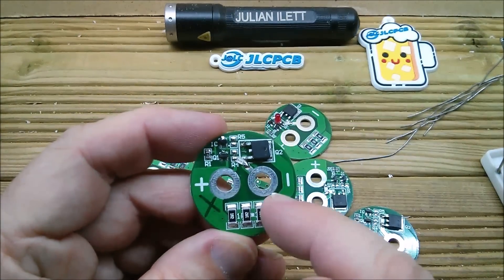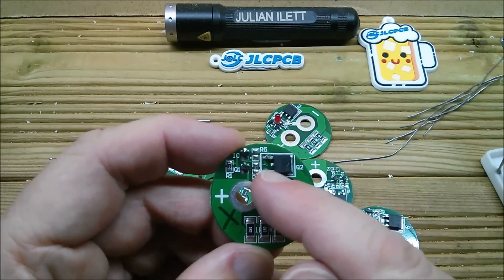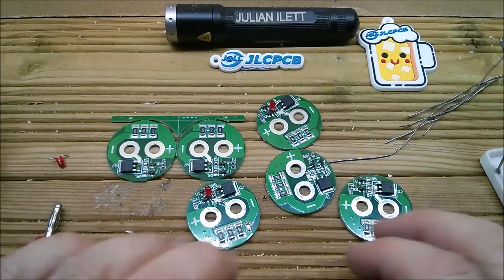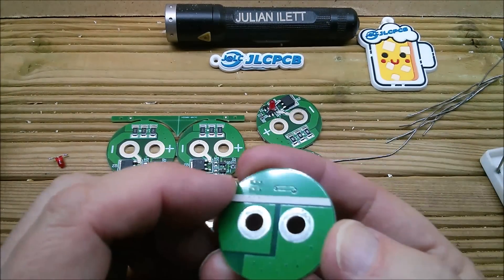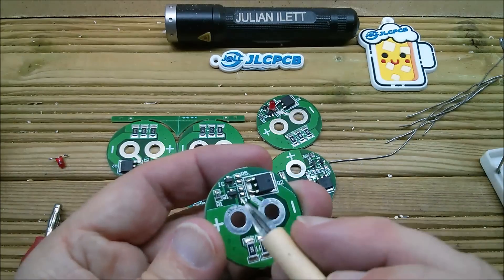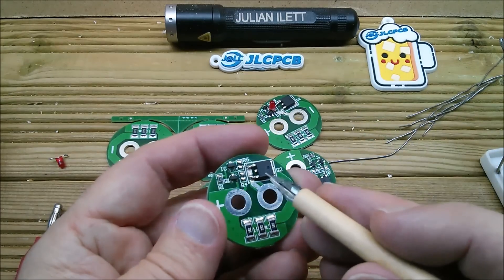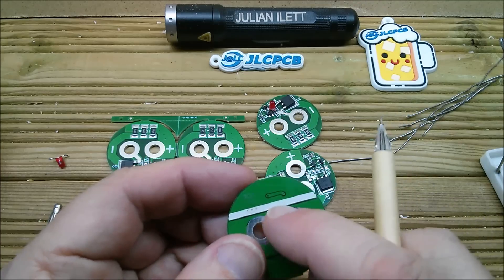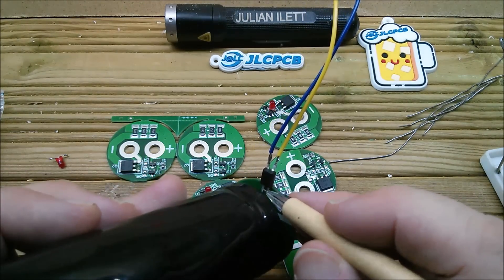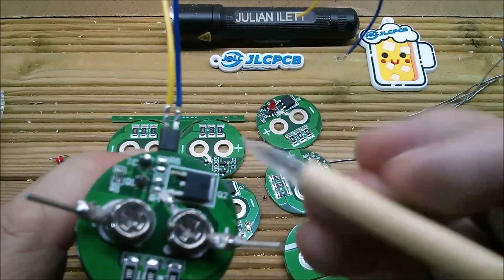I do want to get the LEDs on all six boards in that position. This board has an X on it and doesn't actually work — the protection circuit isn't working on this one — but that doesn't matter because I've got six others. So let's get these red LEDs off, get some blue LEDs on, and I need to cut this track on the back of the circuit board which links the voltage detection part of the circuit to the transistor that switches on and puts current through these resistors. I cut that track and solder my opto-isolator at the two ends, and then the opto-isolator sits there.